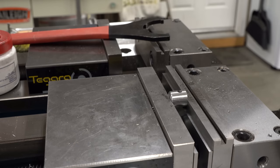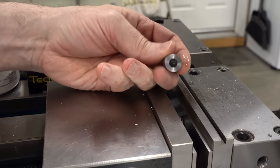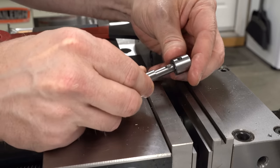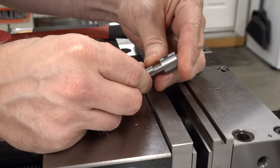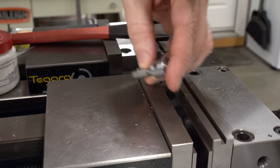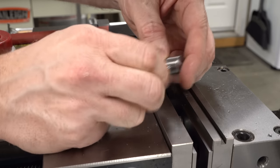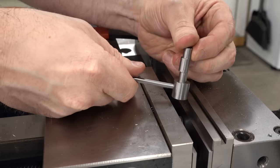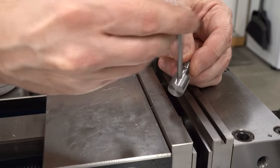And in fact I have a good slip fit on the 3/16ths inch handle. That is all of the machining on this part done. Let's go ahead and check the fit - got the eccentric cam here. We can slide this in and when it bottoms in the bore the hole should align. If I did everything correctly - looks good. Let me grab the handle and try screwing it in. Indeed everything lines up and it looks nice and clean. Leaving the edge of that hole sharp means there will be no shadow line at the joint. That looks good - let's put this thing together.